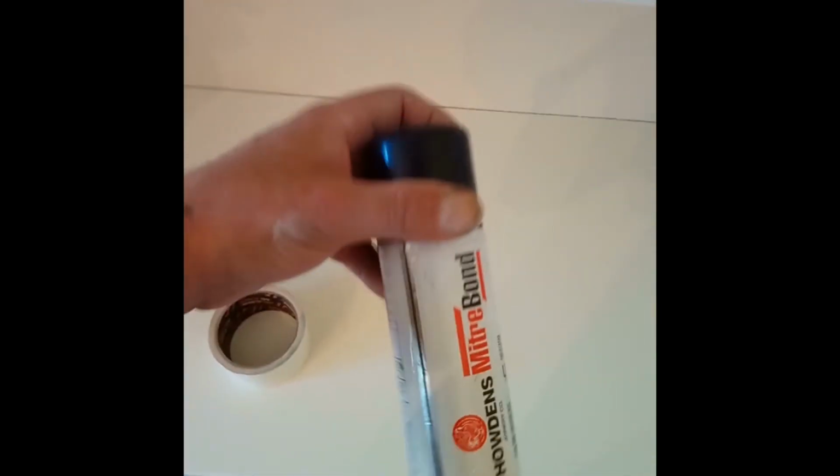Made it parallel, this overhang is parallel all the way up. And I've got a scribe line. Right, I've cut that. That fits on just like that. Stick it on with some CA glue and super glue and some activator. I'll start at the bottom, stick it on, holding the rest off, and slowly work my way up, pushing it into the wall as I do.